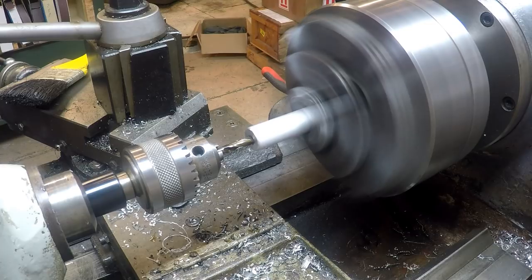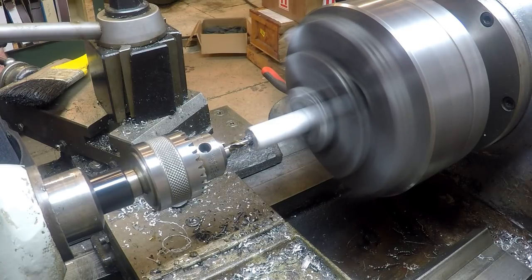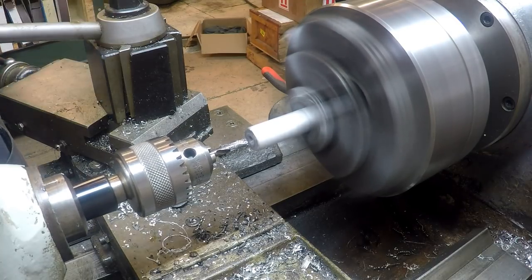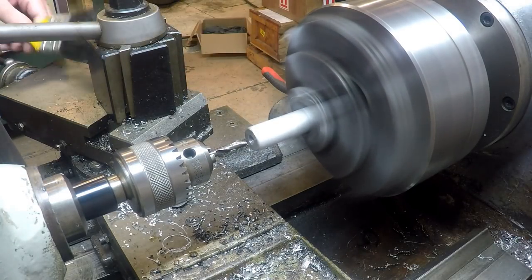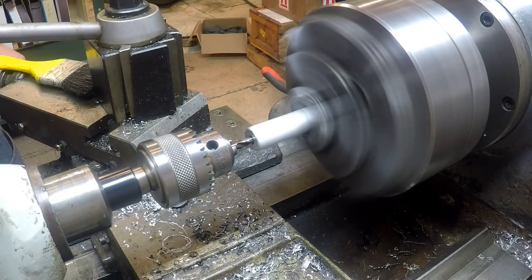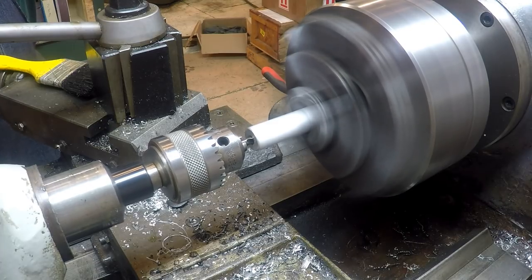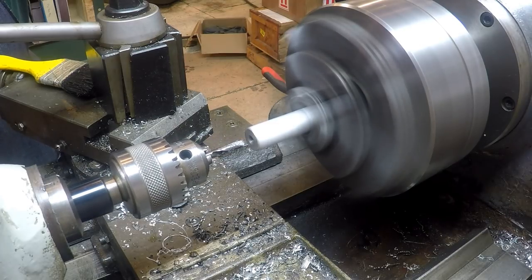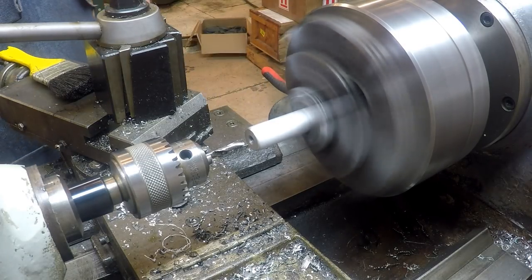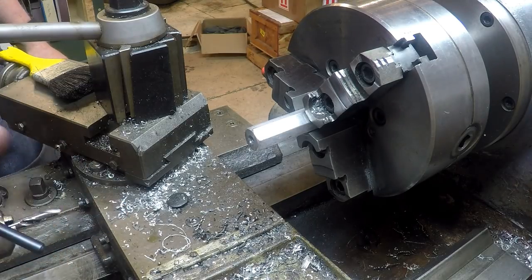Now, this is the tap size for a quarter by 20. So it is going to drill out the vast majority of the bolt, and it's just going to barely touch the crests of the thread. I'm going to clean it off here a little bit. You can probably see a little of that white powdery residue from the Loctite as well. The reason I don't need to use a center drill is because I'm using this little stubby drill. So in the future ones, I'm not going to center drill it. I'm still going to hit it with that little end mill to get a flat spot on it, and then I'm just going to go straight in with this number 7 solid carbide.